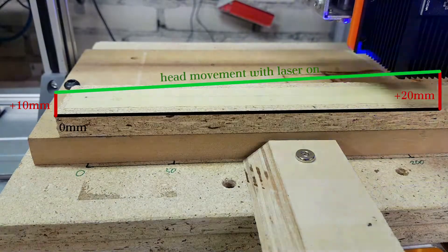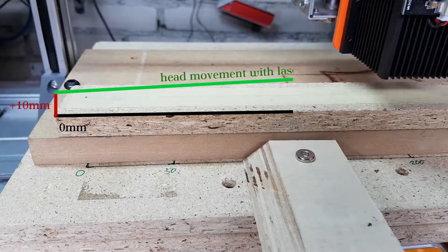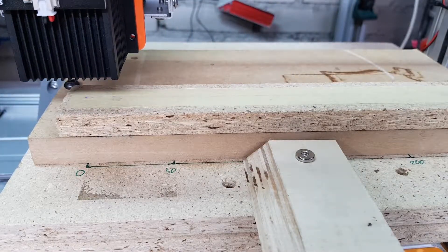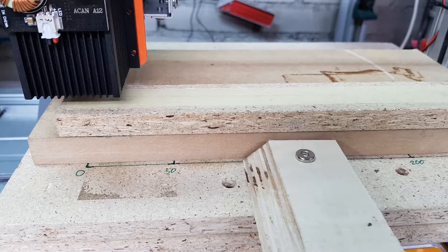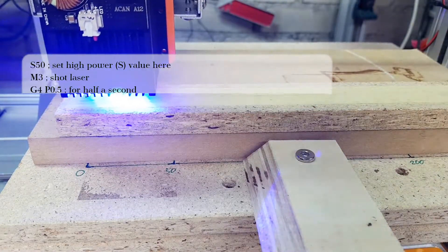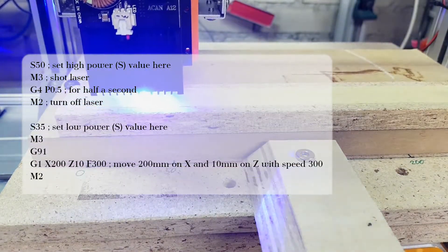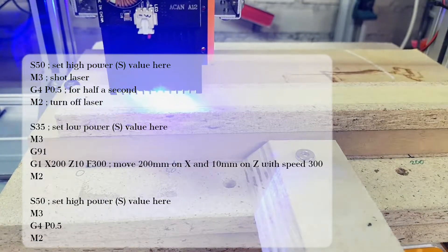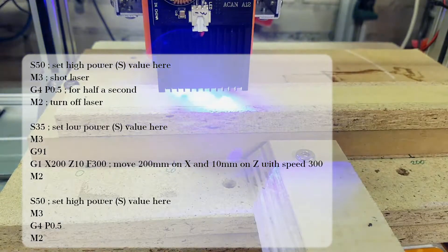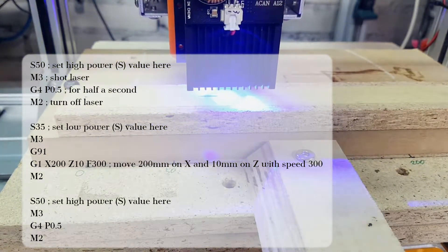The first laser run in this example leaves no mark on masking tape, so the laser power was too weak. We need to go back to the starting point, change the laser power in gcode, and run it again. The provided gcode is very simple and you only need to modify the S value. The first S definition is for marking the starting point, the second is for proper testing, and the last one is for the final point. The first and third values should be high so the laser leaves a mark even if out of focus. The middle value should be as low as possible.